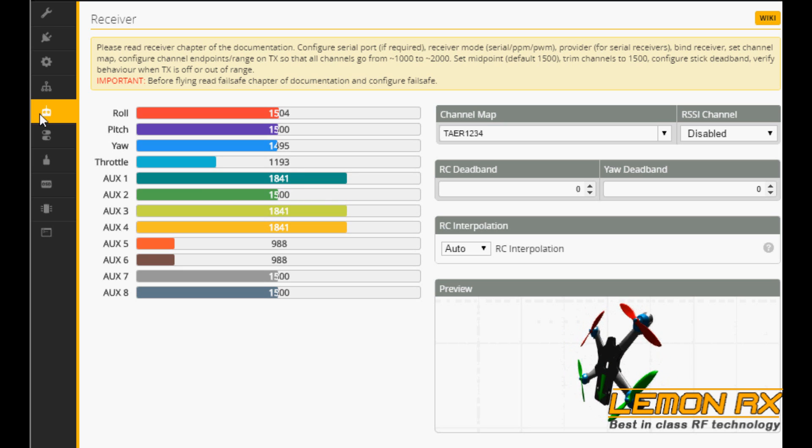It's bound with an 11 millisecond refresh rate, so that's the digital setting rather than the analog servo setting. You can see there's not a whole lot of jitter here, so it works well. It's hooked up — it's an eight channel diversity receiver — so I'm going to go fly with it and thrash it.